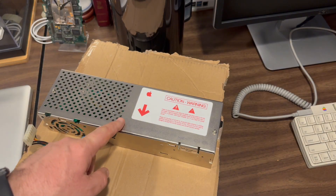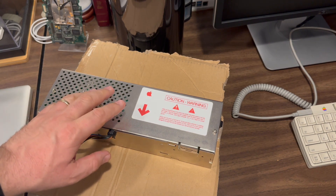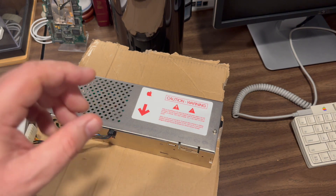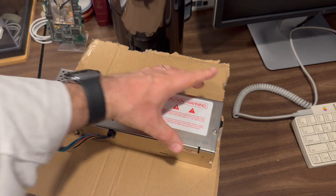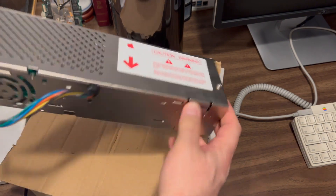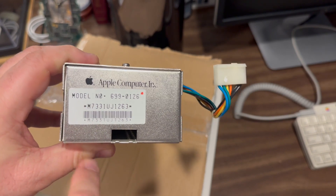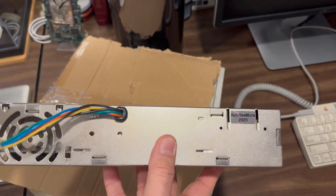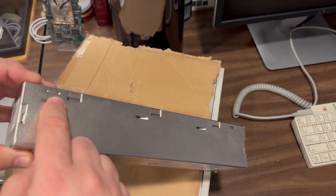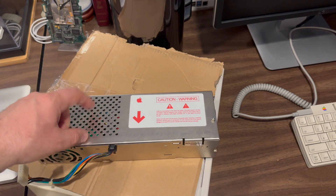Okay, let's take a look at this Apple IIgs power supply. My original intent for this video was to open this case and remove the top piece so we can see the equipment loaded inside. There are two screws on the top of my power supply. In many videos on YouTube showing repairs, there are four screws — two on each side — and the piece just lifts off. However, on this particular version of this Aztec power supply, model number 699-0126, it's a variation where there are only two screws on top, and the top piece continues to the side held in with metal tabs and clips. This power supply is in really good shape, and I was having difficulty getting this lid off.